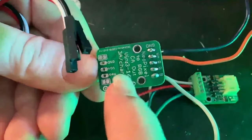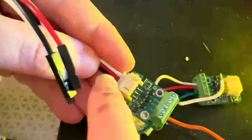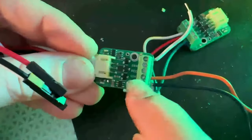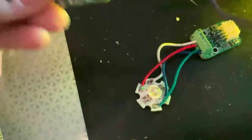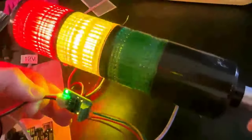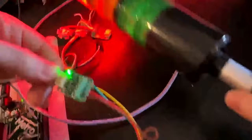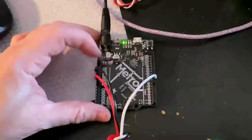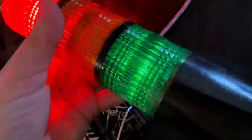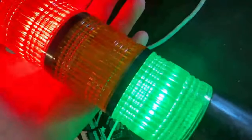Ladyita, what is this? I'm testing a new board design that takes a NeoPixel signal and converts it to an RGB common anode output. NeoPixel power, ground, and data come in here — this is a WS2811 chip. There's an inverter, then it drives three powerful transistors, so it can drive five to twelve volt LEDs, common anode, up to three amps per channel. For example, this ultra-bright three-watt LED is being driven by the NeoPixel signal — so bright the camera is getting confused. And here is a tower light: it takes twelve volts with three channels, and I'm driving it just like a NeoPixel, powered from the Metro's twelve volt input. Instead of wiring up transistors, diodes, and LEDs manually, you just connect it as a NeoPixel and turn on every channel with PWM.